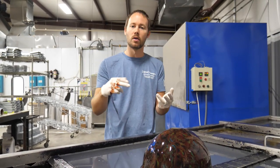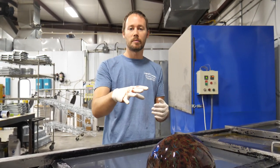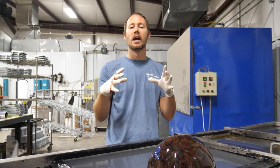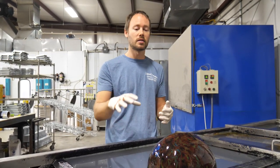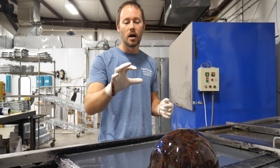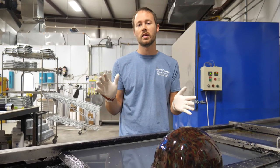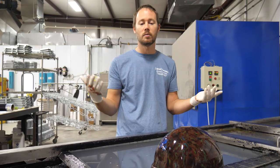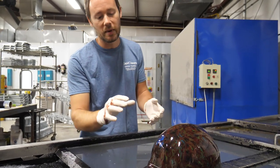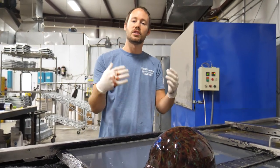That's why paint is really critical in this step — you have to prep it correctly so it sticks to the part, whether it's plastic, metal, or anything else. Once it's prepped, you paint it, and paint doesn't fully cure for a certain amount of time — that's what we call a dipping window. With the paint we use, you can get upwards of a month or two dipping window, and most of the time you can dip within 10 to 15 minutes after spraying.